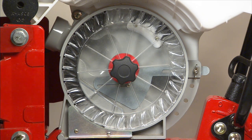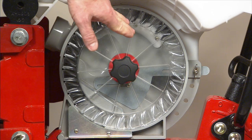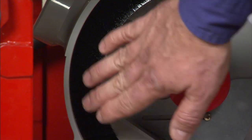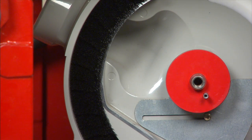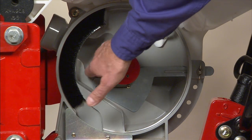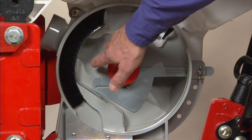The redesign of the seed meter — to put it simply — we've made the best a little better. Our cutoff brushes have been increased in length by about a third more, so it holds the seed in faster before it drops down to the seed trench. We've also increased the air area to make it more uniform and hold the seeds in the cell better.